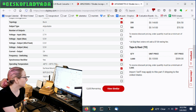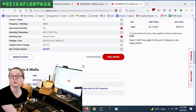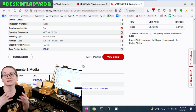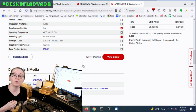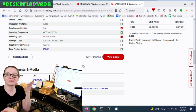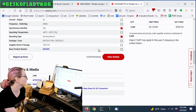Normally I'd check off the package and device too — like I'd want a SOT-23 only — and there were a bunch of SOT-23-5 parts I could get, but some were not immediately in stock. It's a bit of a gambling game: can I get a similar part in three months, or can I get a part right now but with a different package? You have to balance what you think you can get and whether it's worth your time to do redesigns. So let's view similar parts.